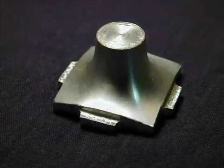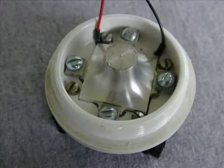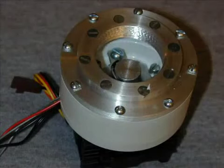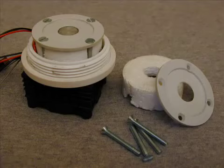This is how you connect the refrigerator chip to the CCD imager. Mounted to the base it looks like this. There are actually two cameras being built. You need to use a little thermal grease between the two parts. Notice here a heat sink with a fan has been attached for cooling the hot side of the Peltier chip.